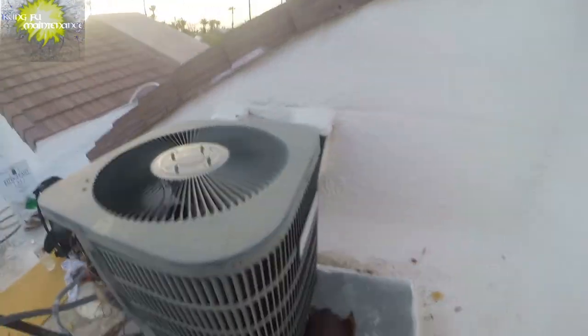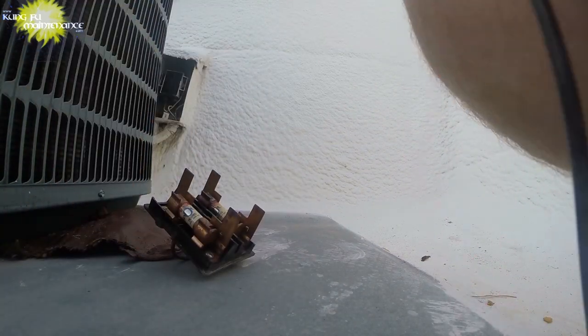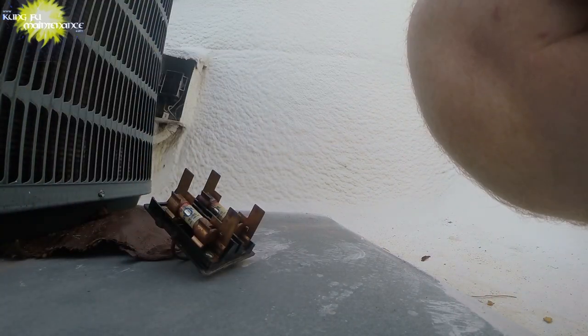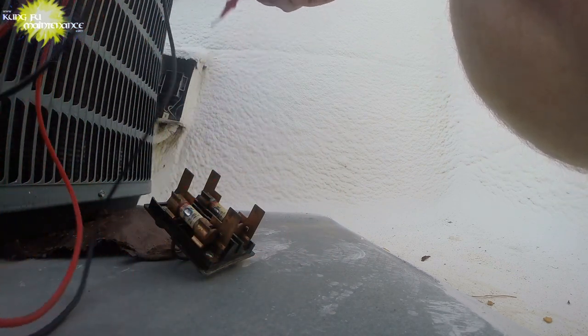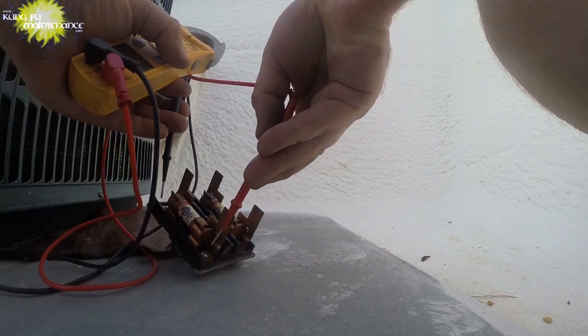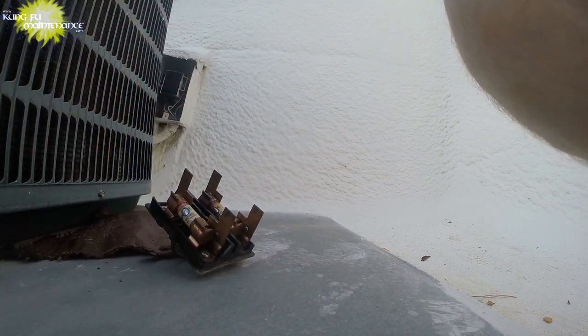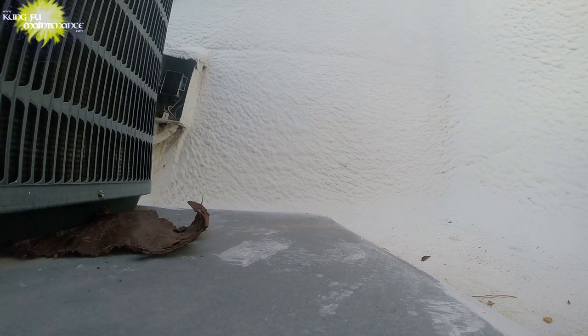We can test our fuses. Hopefully just the capacitors, you know, separated because of thermal overload. It's a weird thing to hope for, but figure goes, continuity test in the fuses. Yay. Oh, they're both good. Okay. They're still blazing hot, but we can test it out. We can see. It looks like just the capacitor failed.